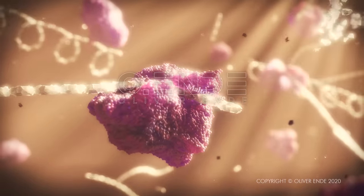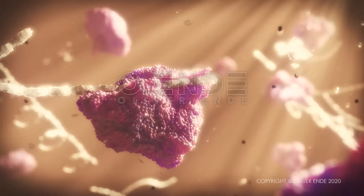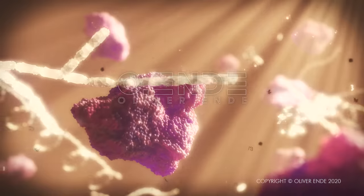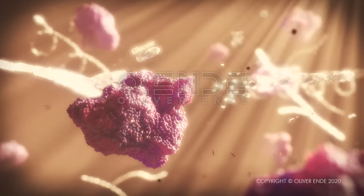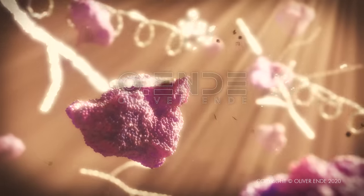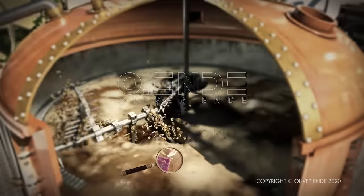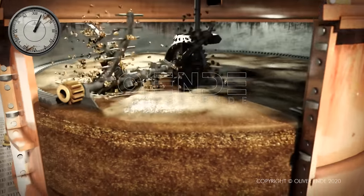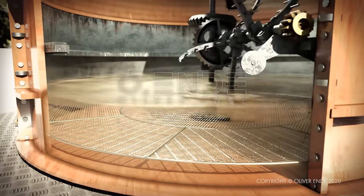Sugar types include maltose, glucose, maltotriose, and dextrin. The conditions under which the enzyme works affect its activity. In order to shorten the processing time, the brewer ensures the best possible conditions in the mash. After 30 minutes, the liquid is drained through the perforated bottom of the mash tun and collected.